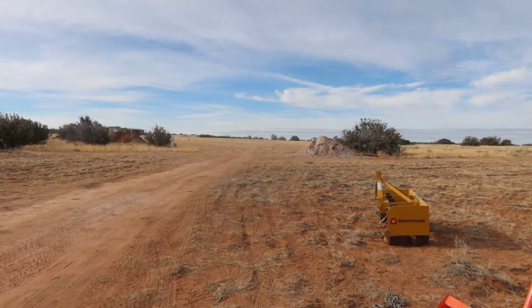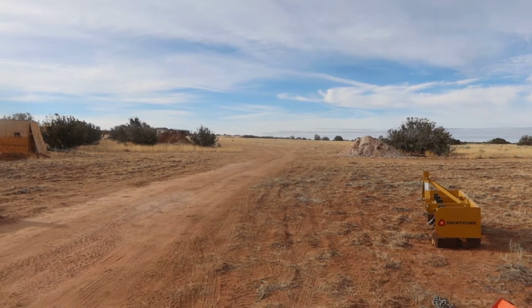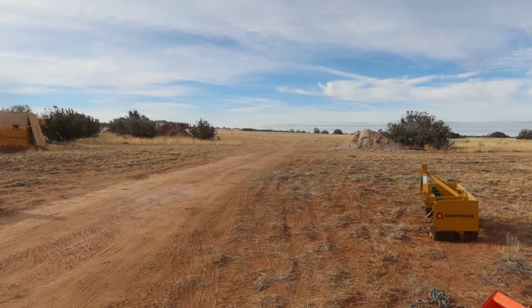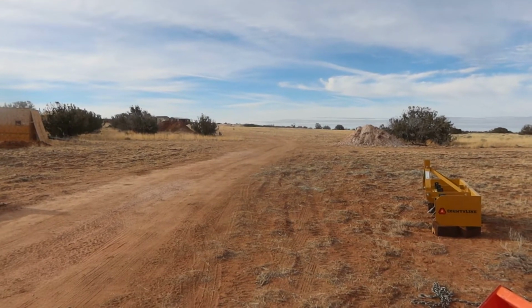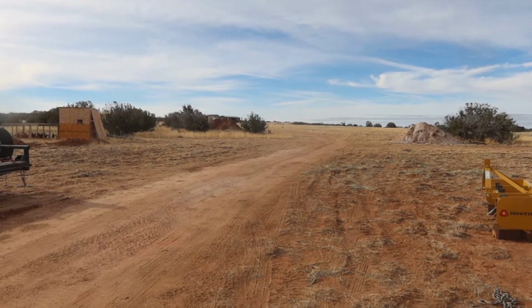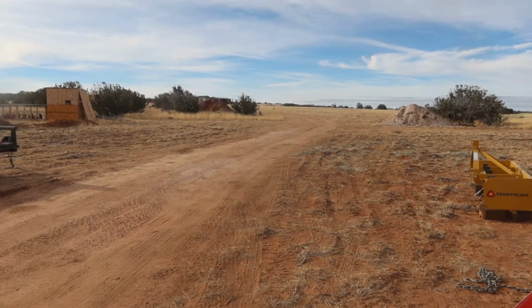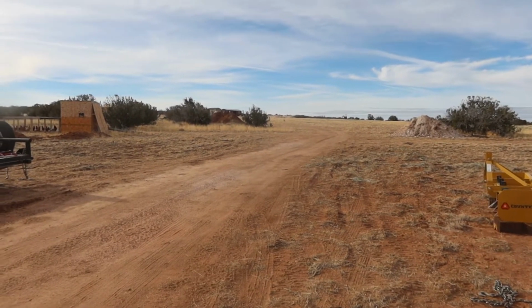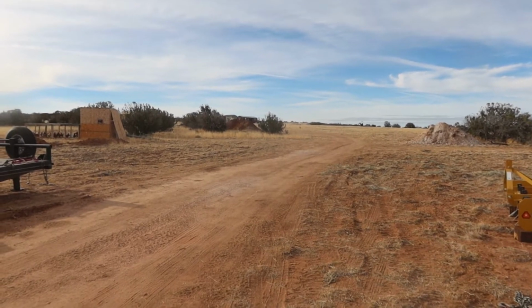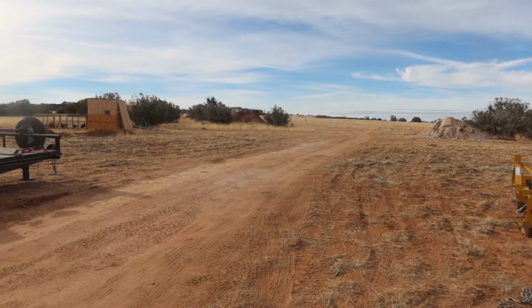I got that mini excavator back there. Got those trees planted yesterday. I still have it for two more days, actually three. Then I have to take it back Wednesday night. I've got a little touch up on the leach line there at the front, where the ABS is coming out of the distributor box. I just need to do a nice little 20 inch trench across the top of them, if even that.